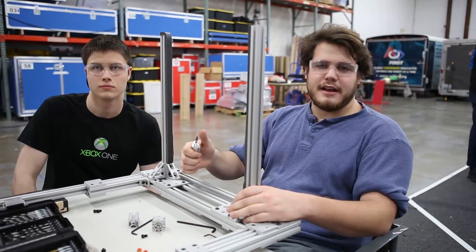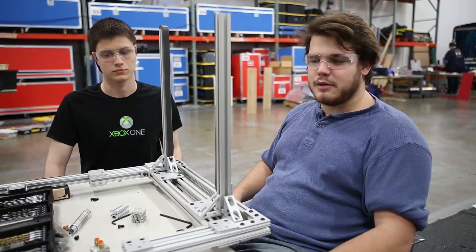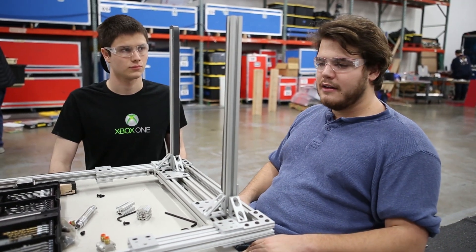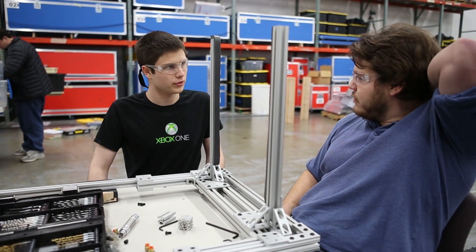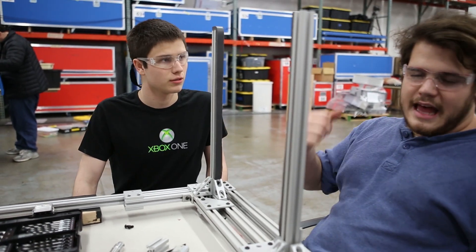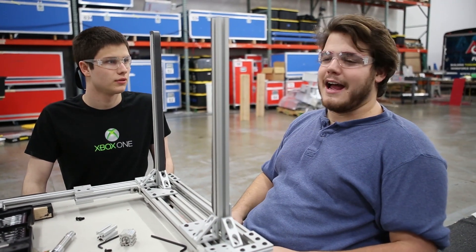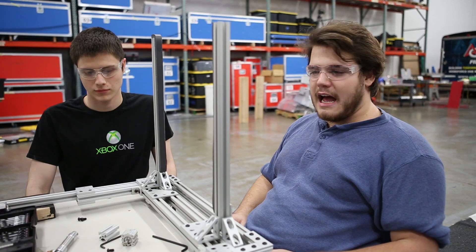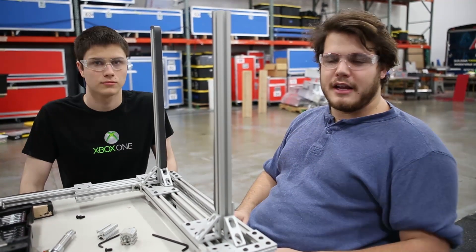The whole thing is built out of 8020 bracketing and the hardware that comes with it. To connect it to the front of the robot we're going to use a pulley system with aircraft cable connected to a BaneBots RS 775-18 motor with some form of gearing reduction that we'll decide on. We only have about a day and a half left. Our goal for the day is to have a working robot that can at least lift a tote by the end of the day — keep up to date with the videos to see if we get that done.